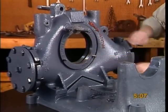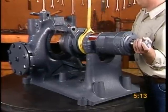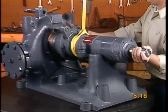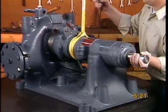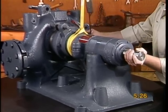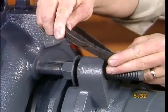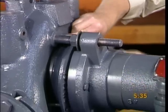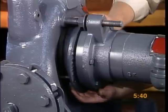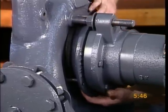You are now ready to install the long cylinder onto the frame. Slide the gland ring onto the intake chamber. Place the long cylinder in the cradle of the frame base, slide through the bore of the intake chamber, and be sure that the draw bolt goes through the lobe on the long cylinder. Install two layers of gland packing ring into the bore of the intake chamber — the breaks in the packing should be opposite each other to help prevent leakage. Attach the gland ring to the intake chamber, but don't tighten at this time.